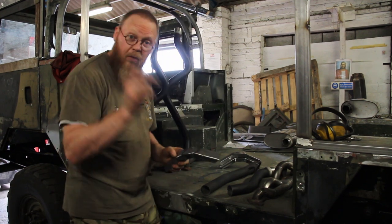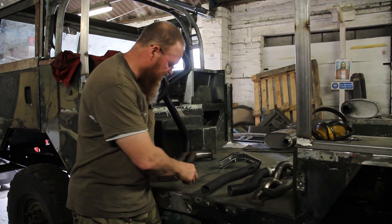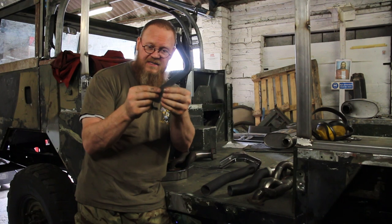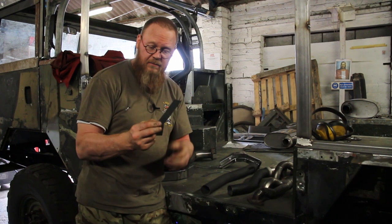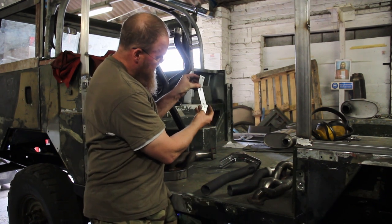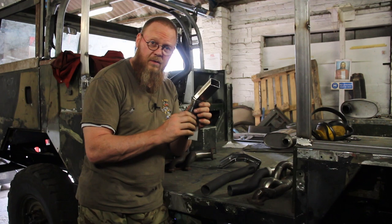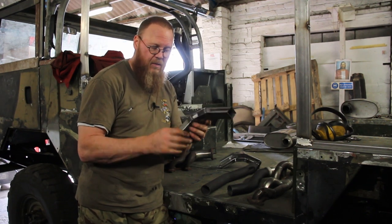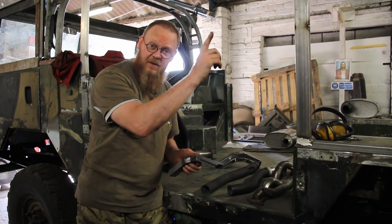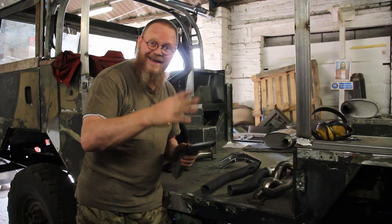How did I make those? Well, I drew the actual profiles out on my bench and then cut some steel pieces. I've got all the mitre angles preset because I don't have a mitre saw to cut steel here — that's one of the things I'm lacking. So I got all these lettered up, and that gave them a form. I made one, and then I matched every other one to that one, so my first one was a template for every other one — they're all identical. Same with the pillars for the side: I made one and fastened the others to it to make sure that when I welded them together they retained the same angle.